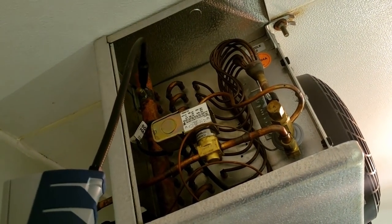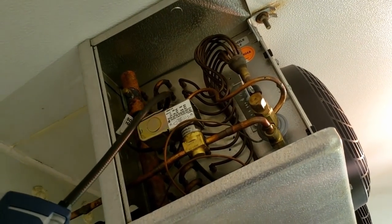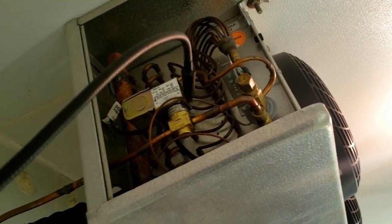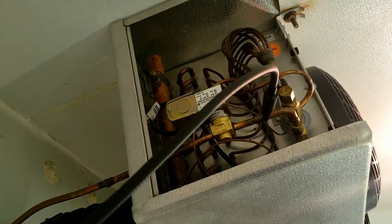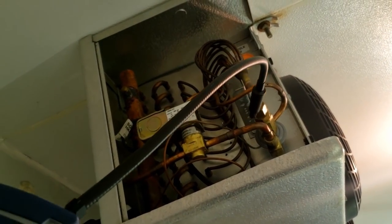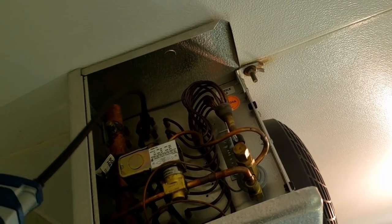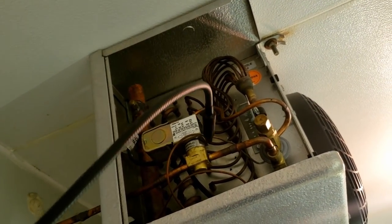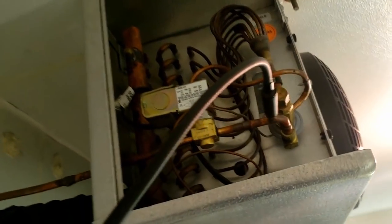I think we're probably okay. I don't have a lot of pressure in here, but I have at least 90 pounds. If it's a big leak like we have right now, that's enough — we should have caught it. I did tighten it up and it's not showing anything at 90 pounds of pressure. But that's on the hot gas discharge, so I'm probably going to go ahead and cut that thing out. I've had to do it before and I just don't trust it.